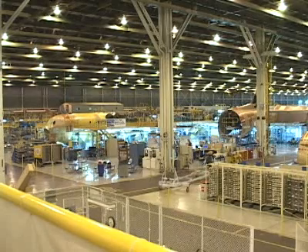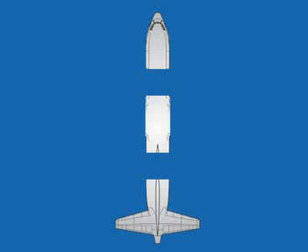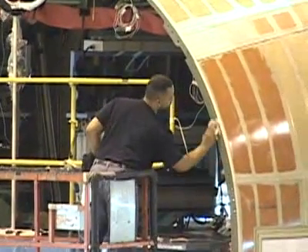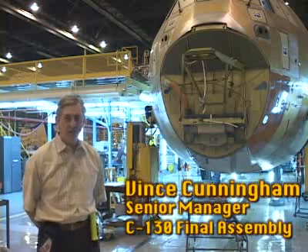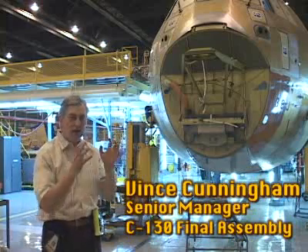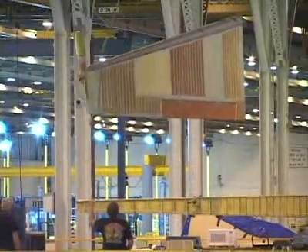Now that the major construction is complete, it's time to put it all together in body mate. This is the first time in the process that a new C-130 takes its distinctive shape. After weeks of construction, there are now three huge pieces — the forward fuselage, the mid fuselage, and the aft fuselage — plus the three wings. Before they can put anything together, workers painstakingly clean the mating surface, then apply a sticky, tar-like substance to the surface. The parts are aligned, sealant is applied, bolts are installed, and the pieces are torqued together. The crew then attaches the wings and installs a substantial amount of wire and plumbing.